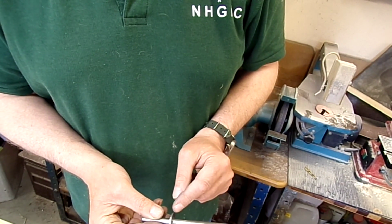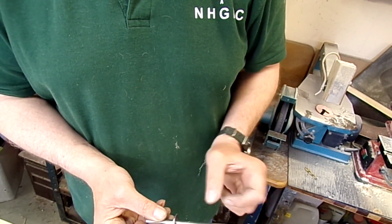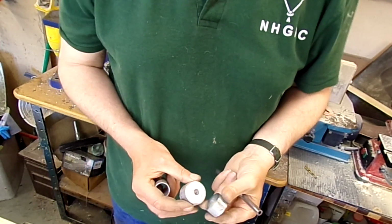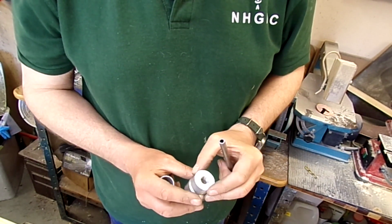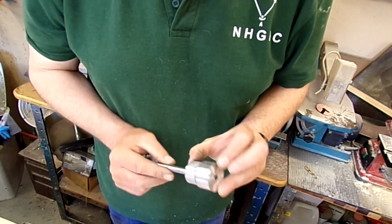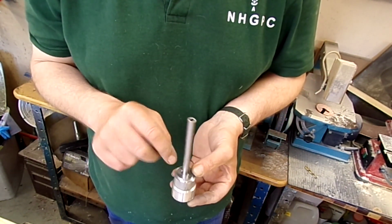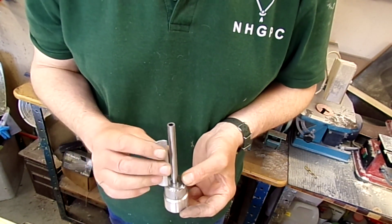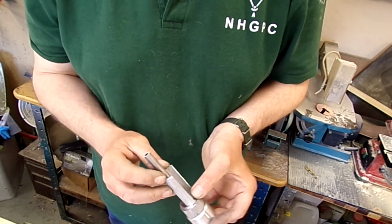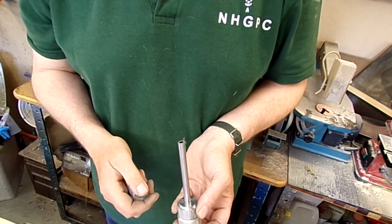And then I've got another spacer tube bit which I'm going to use as a jig, and I'll press on the other washer and tack weld on the side. Let me show you my little jig bits. So these aluminium sections act as a spacer that's been bored out, so it's a loose fit. So that sits flat on there, because as soon as I tack this, it'll open up and it'll try to drop through. So I can get that tacked on, and then I have that little spacer bit so I can put the other washers on, press that on. I can get in and do a tack weld, turn it around, do a tack weld, and I can take it off and go all the way around.